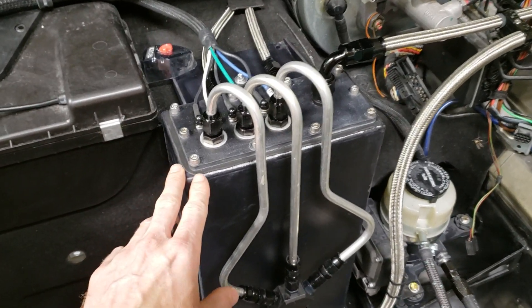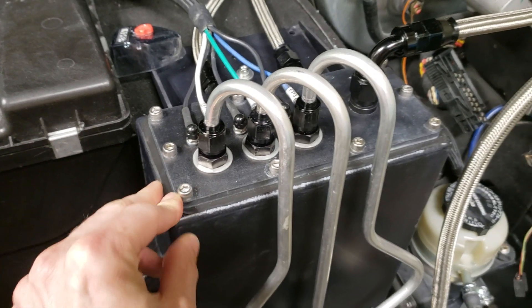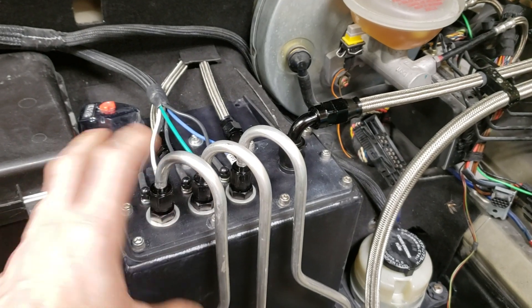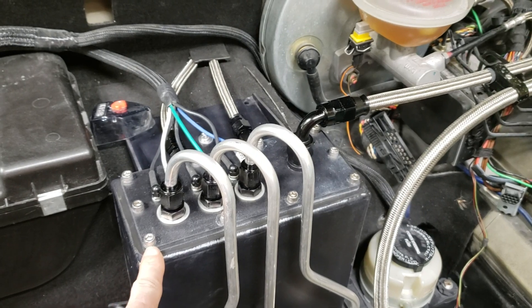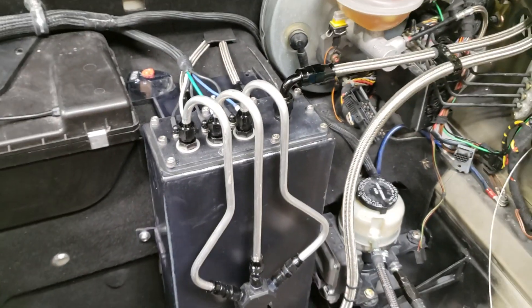So I ended up having to — it's kind of ugly — cut this gasket a little bigger than the cover. Because an O-ring only seals one side or the other, this seals both sides simultaneously. And then I machined a little flat surface under the bolt head, and there's an O-ring actually between that head and the plate. That solved the problem.